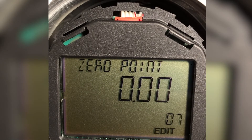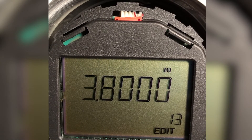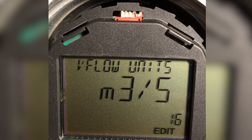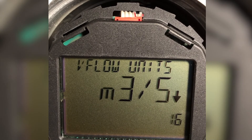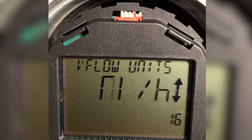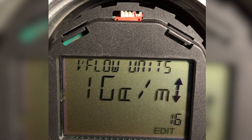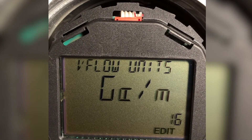I then move to the next setup: setting up the display in the flow units that we want, which will be parameter 16. Looking at parameter 16, it says V flow units and starts out with cubic meters per second. I press the enter button — I see the downward arrow, so I know I have to move down the list to see other flow units. Pressing down: meters cubed, liters, cubic feet, standard cubic feet, gallons — but the I in front means imperial gallons per minute, which is the British way. I don't want that, I want US gallons. Here's gallons per second, gallons per minute — that's what I want. I enter that with the right-hand key.